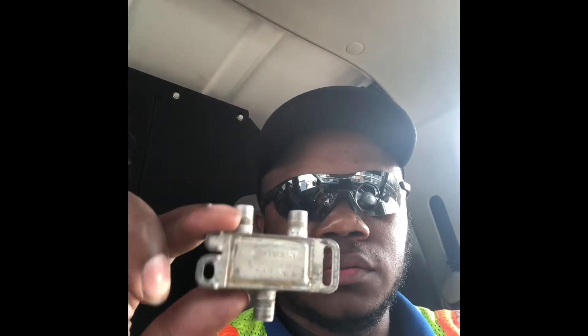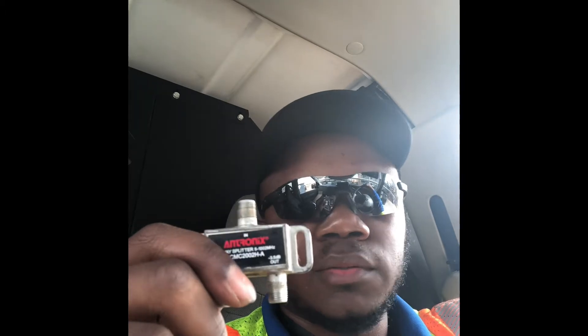So we're back in the van. The problem was he had a bad modem, a bad wall plate, and a bad jumper — the jumper is the cord running from the CPE to the wall plate. I changed that, changed the wall plate, and changed the splitter. You can see how old it looks. Anytime you see a splitter like this at the CPE inside the home, whether it's a house or apartment, I always change it out — even if it's at a tap — because these go bad real quick. Job's closed out.